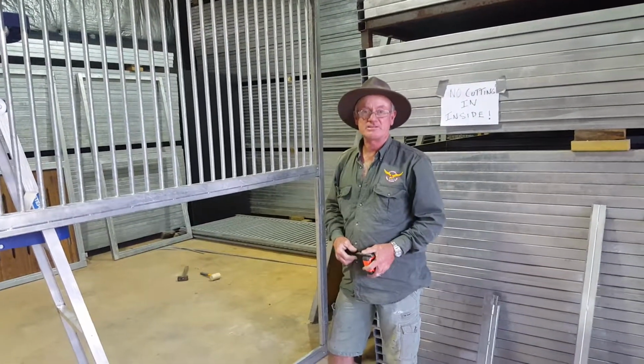But before you do that, what we have to do is measure 650 mil, and you do it from the 50 by 50. There's your 650 mil for the mark, and then down 475. So from this point, 650, mark it. From this point, 475 and mark it.